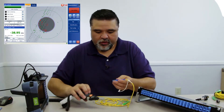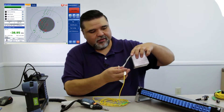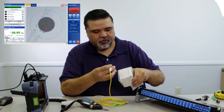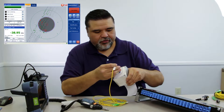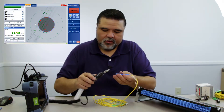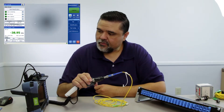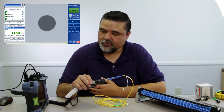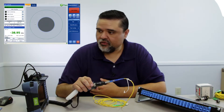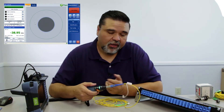So if you want to clean this connector, we unplug it and remove the tip. I can start with the dry method — pull it out, hold it down, and quickly clean the end of the connector. Put my bulkhead tip back on, plug it back in, and we'll see what it looks like now. There's the auto-center again — I just love the auto feature of this. It really is quite useful and a significant cost savings. And look at that — now we have a pass and we see green. That's what we want, and it's as simple as that.